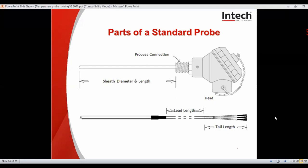Other factors that can be added to these options can be pot seals between the lead and stem to allow for better seal against moisture ingress, or the ability to have smaller stems. With thermocouples, we can potentially go down to 1 mm stems. Other factors that can be added are threads partway down the stem or running nuts, Tri-clover or RJT with a big castellated nut, typically used in dairy applications with a highly polished finish for hygiene.